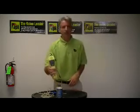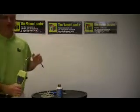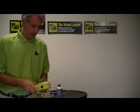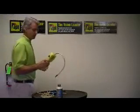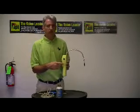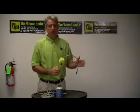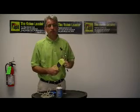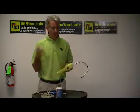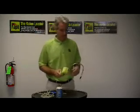The LEDs across the top of the unit begin to flash, the alarm goes off, the tick rate increases, and you know that's where your leak source is. Another nice feature on this unit is a spot for an optional ear accessory. You can plug the unit into your ear so that customers in refrigeration environments who don't want to hear the tick rate or alarm won't. You can have it directed just into your ear.